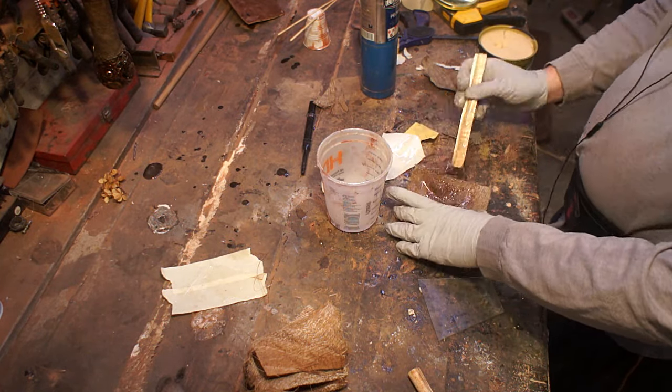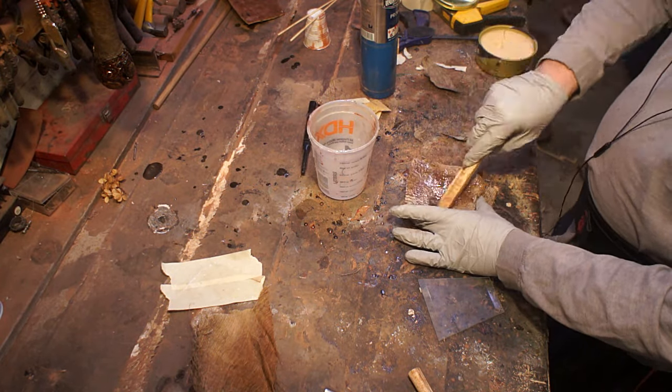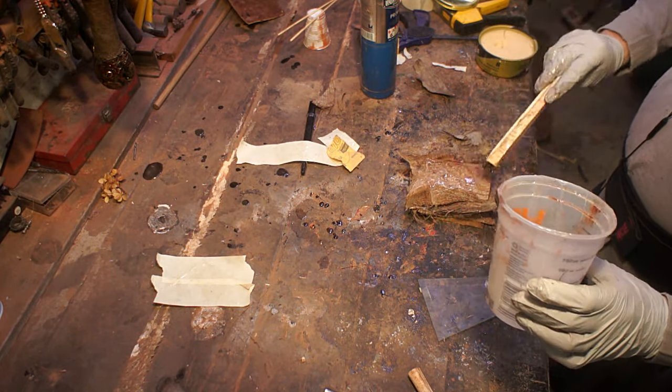To make the scales for this, I'm going through the same thing you do with carbon fiber or fiberglass — wetting down the layers, sticking them together with some two-part epoxy resin, and then sandwiching them in between these two pieces of glass.